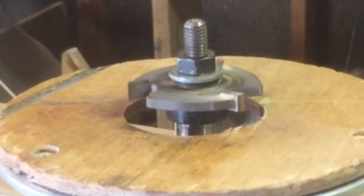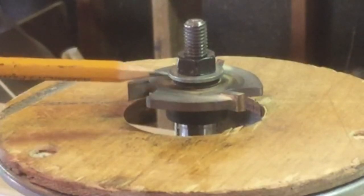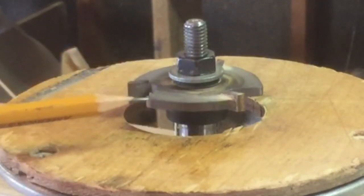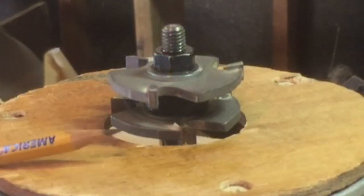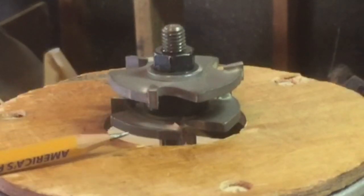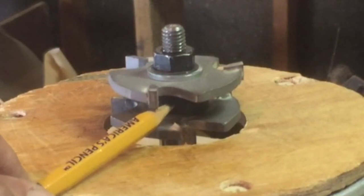After I got all my boards for the door straight-edged and ready to put together, I rigged up my router with a tongue and groove router bit set. As you can see here, I have the groove bit set up — there's a little bearing right underneath that runs against the stock and you have to play with this to get your groove exactly in the center. This is the bit that cuts the tongue, and there again you can see the bearing — it's in between the two cutter blades.